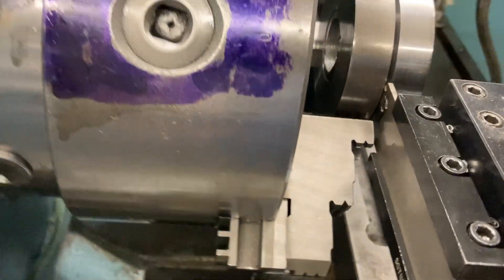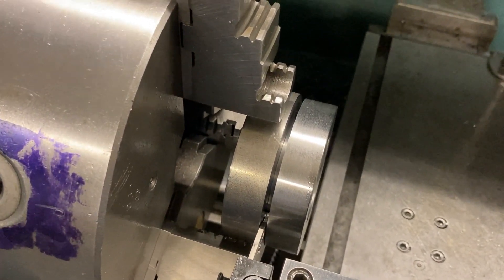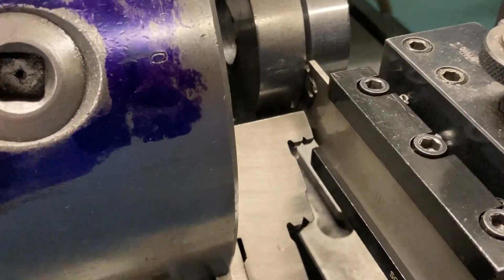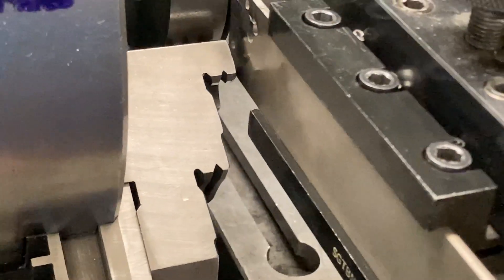I had to stop — I want to show you. Almost had a little bump into the chuck. I'm working close to the chuck. I wasn't this close on all my other setups because obviously the hunk of material was bigger when I started, but it's getting smaller and I want to make sure I use it all. As you can see right there, I couldn't get to my cutoff diameter because the blade's not sticking out enough. I could get to 2.250 on the diameter but I need to get to 1.750 for it to part off, and I don't have enough there. So I've got to project the blade out a little further so it cuts off without smashing the tool holder. I'll back it out here and show you this cutoff tool.